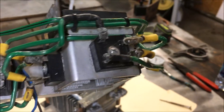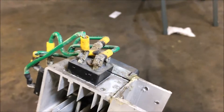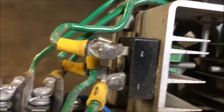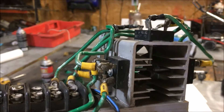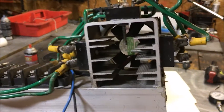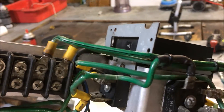Yes, you can connect diodes in series to accommodate voltage requirements — it does work. I've had this thing running forever. I'm going to post this video for anyone looking this subject up, because I discovered a huge vacuum: nobody has any information on connecting diodes in series. These are 50-volt diodes, which has given us a 150-volt bridge rectifier.